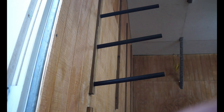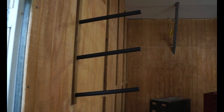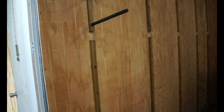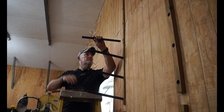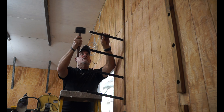Here you can see the horizontal supports and the angle. It can be at any angle — you just want the hardwood to be able to slope back toward the wall so it doesn't slide out or slide off. You'll also notice a gap between the vertical supports; that gap in the middle is due to a horizontal metal stud that runs around the entire metal building. I was able to set the drill press at the 12–15 degree angle and drill all the holes on 12-inch centers.